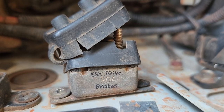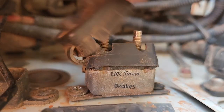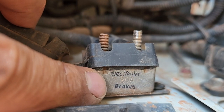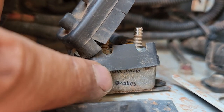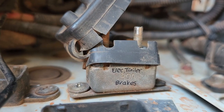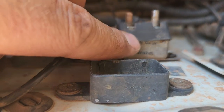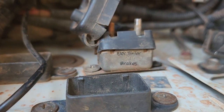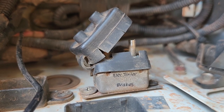The reason I'm sharing this with you is just to understand that when you come to selecting components, make sure you understand how they work. This seemed like a great choice, but in this situation, because it actually relies on temperature — not actual current — to activate the circuit breaker, it wasn't a great choice here. So if you ever use a circuit breaker like this, understand that in very hot conditions it may trip when you're not expecting it to. I hope that helps — like and subscribe if it does, and I'll catch you next time.